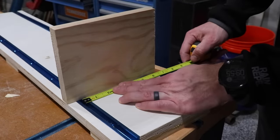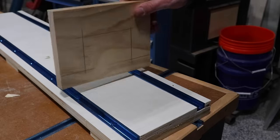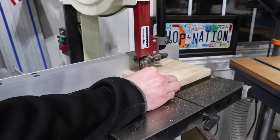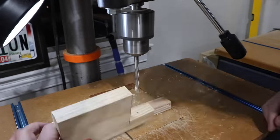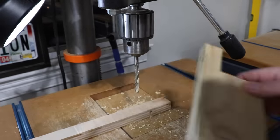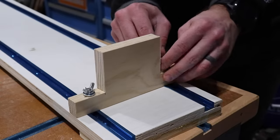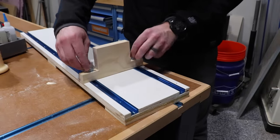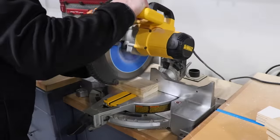When figuring out the dimensions of these hangers, I took all of the various drill sizes that I have and took measurements from that. Then I cut one out to verify fit and function, and now it's just a matter of banging out eight exact copies. Anytime you've got a project like this and you've got a lot of the same thing you have to make, take that little bit of extra time and set up a stop or a jig to make all of this repeatable. It not only makes your life easier, but in the long run you end up doing it in a lot less time.